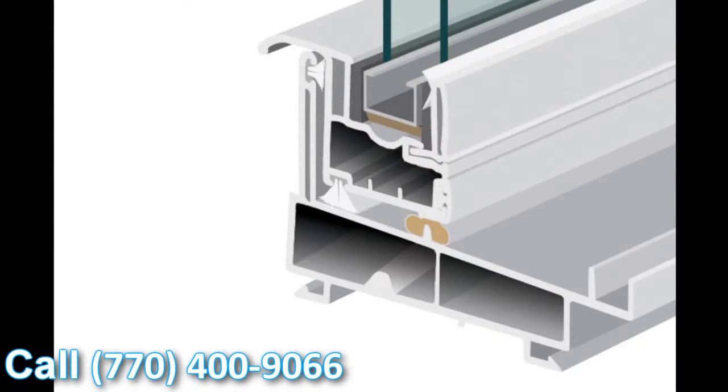Taking a closer look at the corner cut, I wanted to point out the straddle gasket. When the window is engaged and locked, you can see this Qlon weather stripping goes over the top of the upturn leg and creates what we call a straddle gasket. When the window is locked and air or water is trying to get in because it's windy, it has to go underneath the straddle gasket, over the upturn leg, and underneath the upturn leg.